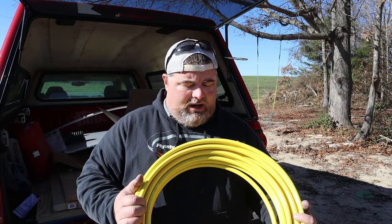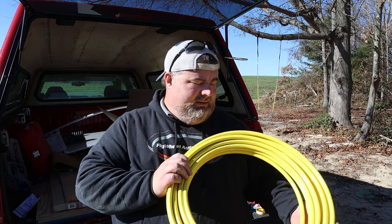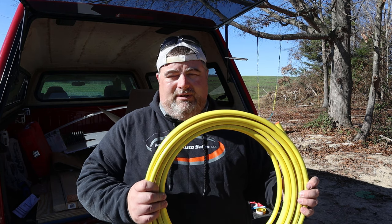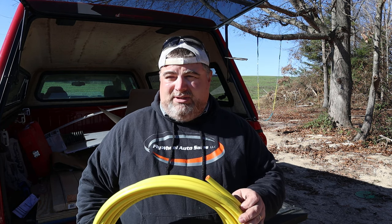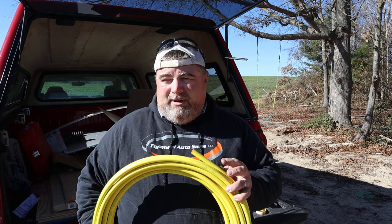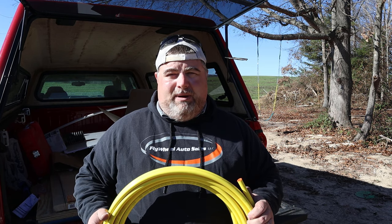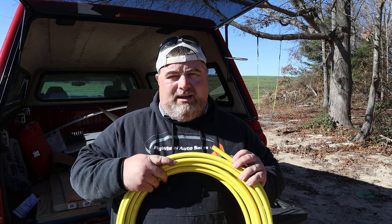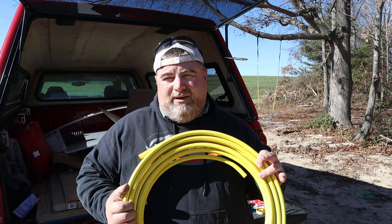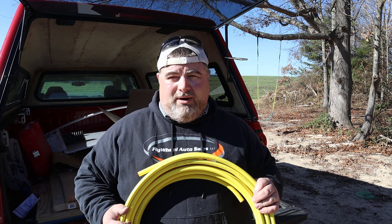Yeah, let's go. We're going to talk copper tubing for gas lines. So you've basically got a few options. You can't just put any kind of copper in. This copper tubing that my brother has bought has a polyethylene cover to it. It's a pretty thick jacket. Comes in real handy as just extra protection. So you can pass through something and this will act as a sleeve if you're going through masonry, something like that. This is just a little bit tougher. This is a direct bury copper, which is a pipe you can put in the ground. It's not going to rust, but having this on there really helps when you're direct burying it for rocks and things that could come in contact with it. It just protects the copper. Also, it's yellow, as yellow is the color for gas. The internationally accepted color for gas, as blue is accepted for water.